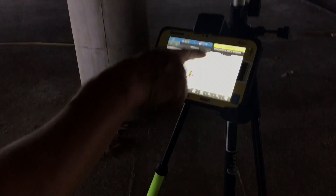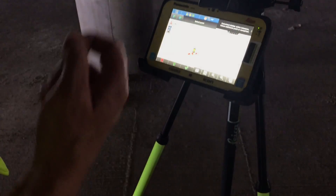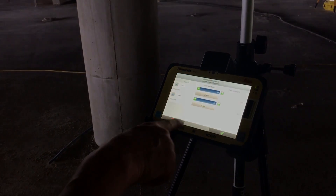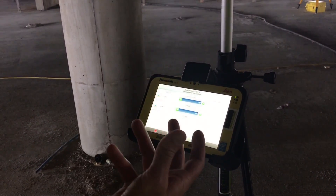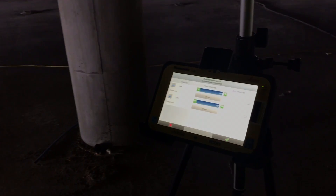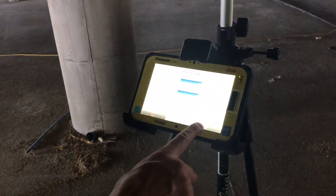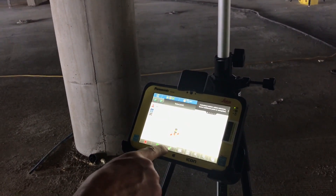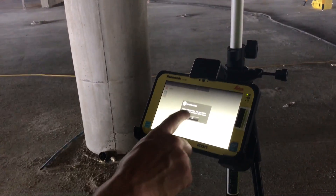After I hit Store, it immediately tells me at the top 'calculated within tolerance.' But within tolerance doesn't mean it's good, so we want to double check by hitting the medallion. We have zero inches by zero inches, so that means we're really good. If these numbers vary around a half inch or so, we'd want to shoot three control points to tighten it up. But right now we have good control, so we're going to hit the check mark and then the final check mark at the bottom. That saves our setup routine.